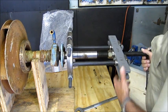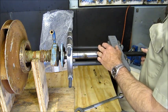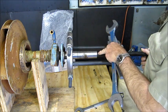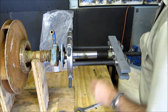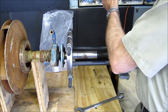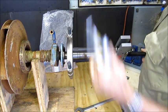All right, we're supporting this rod here with the wrench so that we don't spin this into the center on the end of the shaft. Many mechanics will sit there and twist this shaft holding this nut right here because it seems easier. But in the rotation of this, you mess up that center right in the pump. Now there's a couple cups that put on there, and there's a couple of these tips here that swivel. But as long as you don't rotate it, you're gonna be fine. And the bearing is letting the whole thing turn, so that's cool. That'll work.